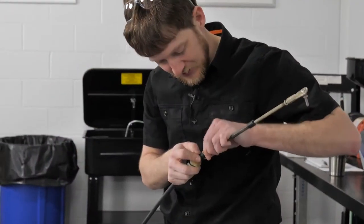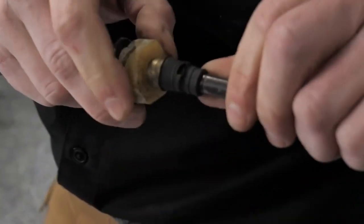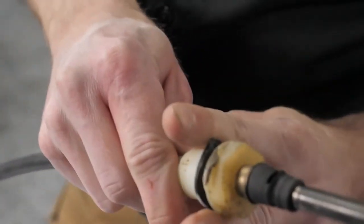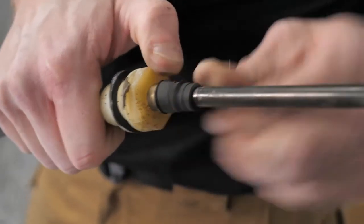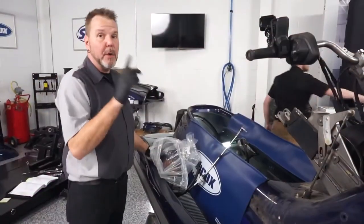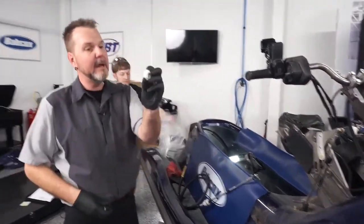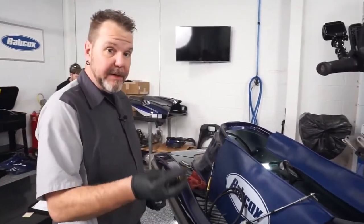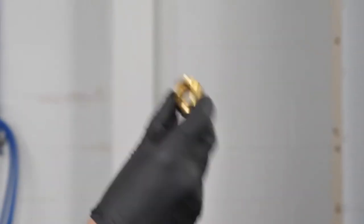Here's a surefire sign of wear — there's a hole in the rubber boot. This is where it seals up against the hull, and in the right conditions this part is underwater. So water can be introduced right in around the cable sheath. If you noticed on the last cable we just took off, we had a plastic retaining collet to remove. SBT has now given us an upgraded part on that, and you can see the difference in quality.